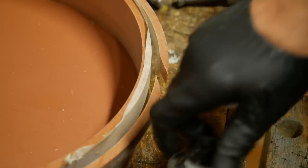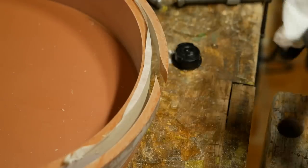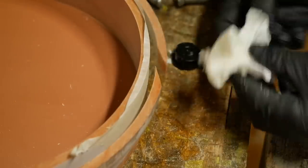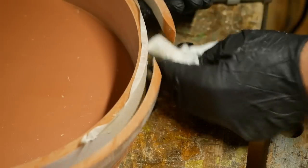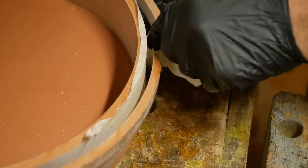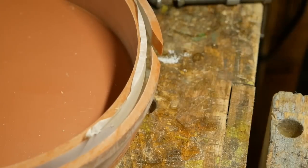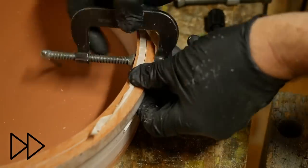This plastic and plastic welding is actually kind of fun to play with. Goes pretty quickly. I mean, you have to leave it overnight to dry. Certainly easy to bond, and the bonds seem just as strong as the base material. I tried turning a test piece on the lathe. Bonded bit turns just the same as the rest of it.